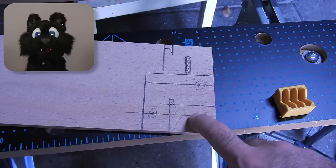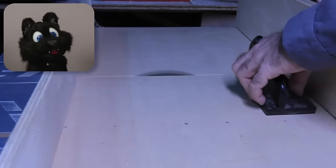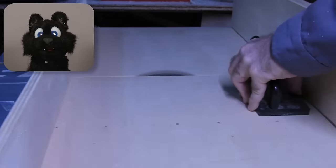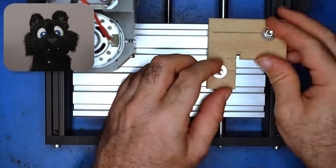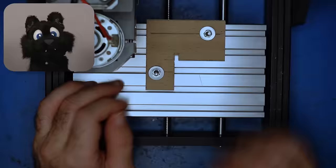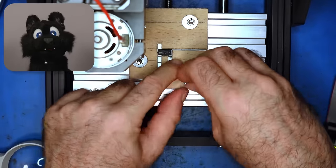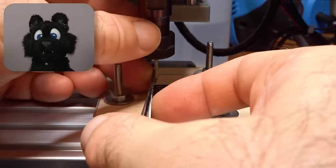It was a bit nerve-wracking. That cheap CNC mill is mental. The G-code has to be in a very specific format, like no trailing zeros in the numbers, for example, amongst other things. But it worked. After sanding off the discoloration, I put the button into an improvised clamp, engraved the text, filled the text with a marker pen, and sanded off the excess again.